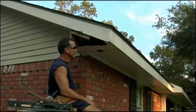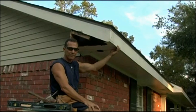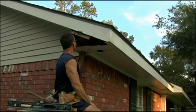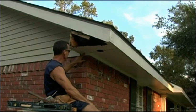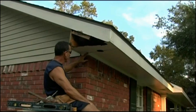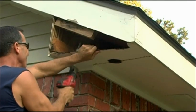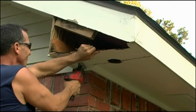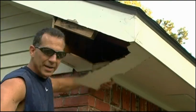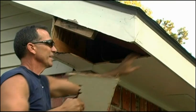We're loose from here, and everything's loose except for this face part. We don't want to pull this down and crack that fascia, so we're going to take this part right here and get it loose. I'm going to have to cut it since this is one solid piece — I'll take the saw up to here and we'll be able to pull that little piece out. Wiggle it down a little bit, be real careful, and it comes right out. See how it's rotted.